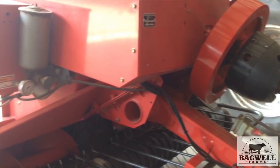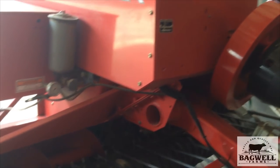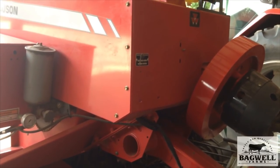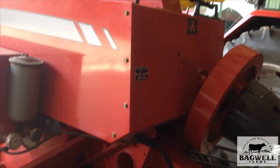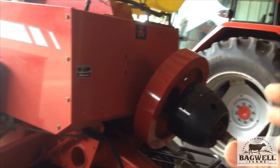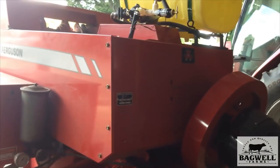The Agco system had two tips, with a wider bar that uses all three different tip sizes, because you use three different size tips for each moisture level. For each moisture level you go up — there are three levels, from 16% to 23%, then 23% to 25% or so, then another that goes all the way up to 30%. For each application level you have to change the tips out. I'm never going to bale hay over 23%, because once you go over that you have to put a lot more of this stuff per ton of hay, and that's when your costs really go up.